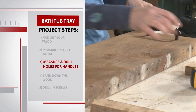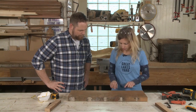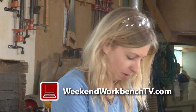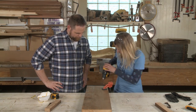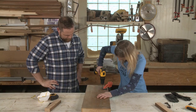Based on the length of our handles, we measure and mark where to drill the holes to attach them. Now that we have our holes marked, we're going to turn the piece over, clamp it, and then drill through — trying to go as straight as possible because that will make it easier for the hardware to feed through. Megan drills one hole and I drill the other, and we repeat the process on the other end.